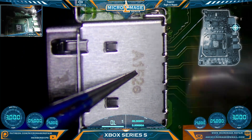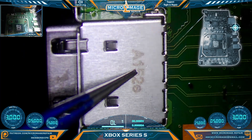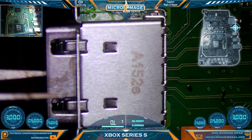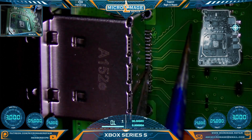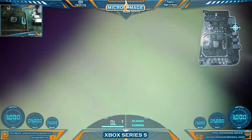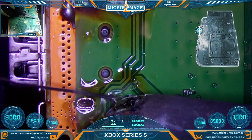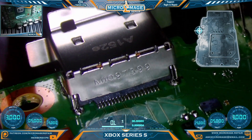Okay, now we're going to concentrate on our pins. Get them down — I'm not overly concerned about the pins, we can touch them up later, but I want to get those hidden anchors down. Let's do the nudge test — very delicate. Yes, looks good. We'll raise our port a little bit so we can get a look at these pins, and ladies and gentlemen that is solid — excellent. Flip the board, apply some more fresh flux — we want good feed-through to the other side, so be generous here. Excellent feed-through, it's exactly what we want, and that's exactly what we get from the preheater.